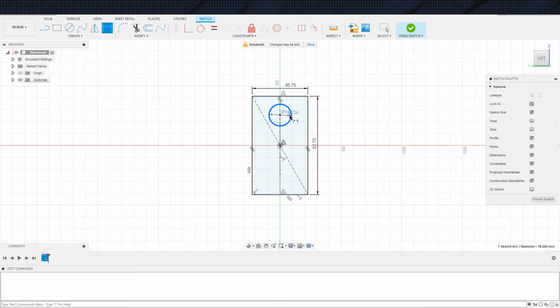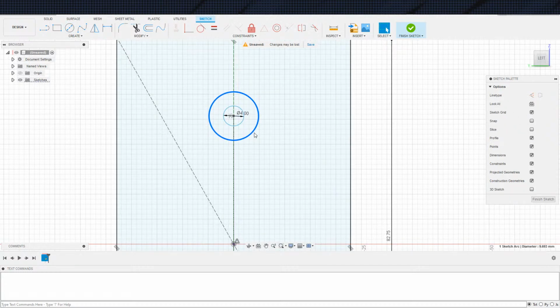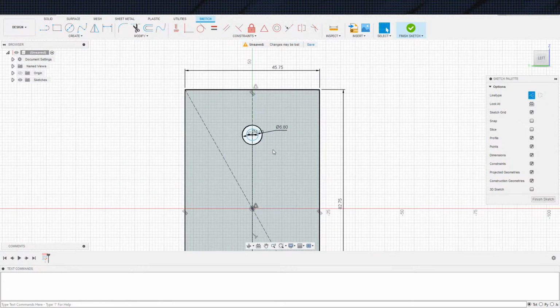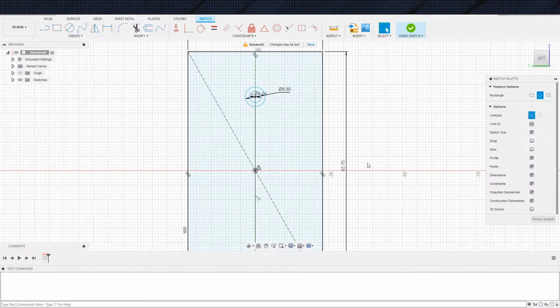And these are 4 millimeters. And the head on a full 4 millimeter is, I forget. Although I do have the countersink itself written down. I did not get the head size. Head size is 6.8. And then the countersink was 1.9, but we're not quite there yet. I still have to do the cutout for B over here.